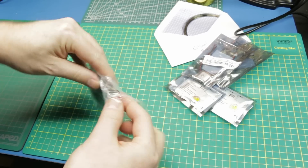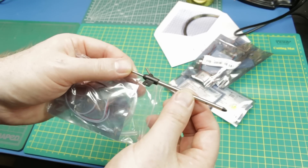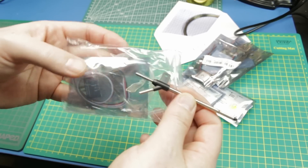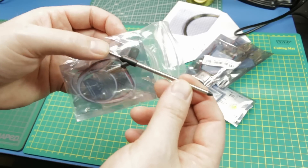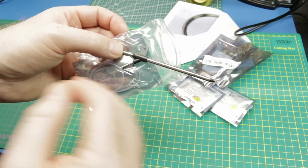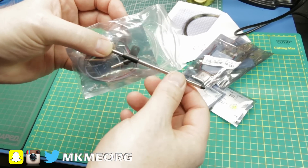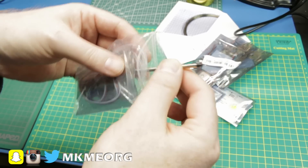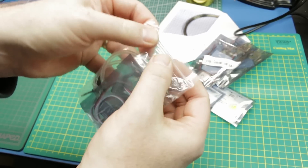This is for an aircraft and will also go into our flight control. This is a pitot-static tube so I can measure true airspeed - I had one of these on the EPP FPV with the Cyclops Tornado. I'm not sure how people fly autonomous aircraft without an airspeed measurement. You see all kinds of videos on YouTube where the plane just falls out of the sky, particularly after a turn - usually into a tailwind condition at too low airspeed and then they stall. This will allow you to know airspeed and determine wind direction and speed by tracking the difference between airspeed and ground speed via GPS.